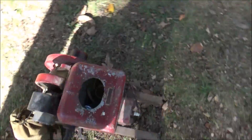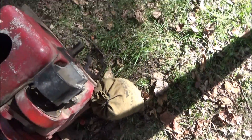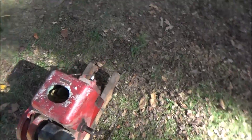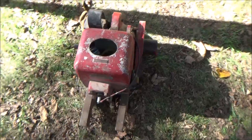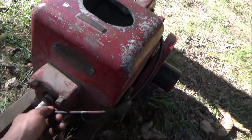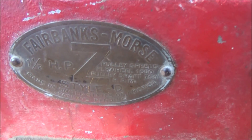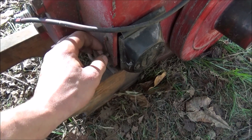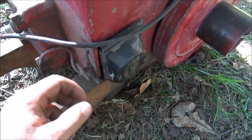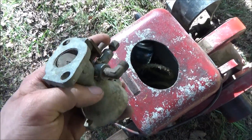Back in our spot here — I failed to mention my little new toy. So the story goes, it was Saturday night, about eleven something at night. I come back to my spot and this is just sitting here. Someone must have given it to me and I really appreciate it — friends of mine here know who it was. It's a Fairbanks Morse Z, style D. The carburetor's needle valve was stuck in the boss and they snapped it off — I could probably JB weld it back together, but our buddy Rob Charles had another carburetor, so 15 bucks later and we're good to go.